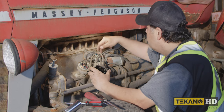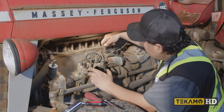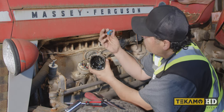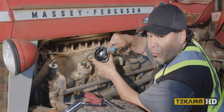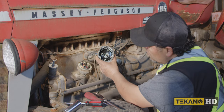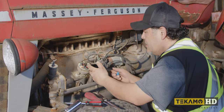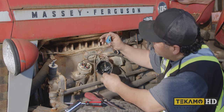The electric spark should come from this ignition coil, this round cylinder right here, comes in here, goes into the center of the cap, and through this rotor, as it's turning, it matches up with one of those electrodes and it goes out to your spark plug, okay? So you want to see the condition of those as well, and this one looks like it's in really good condition, so someone actually replaced this cap and it looks like new inside. Okay, same as the rotor.